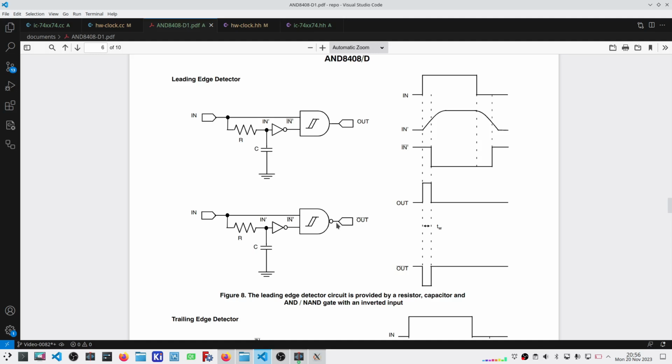Well, I need a couple of AND gates added in. And surprisingly enough, I have two that aren't used. And what I want to do is drop those into the circuit ahead of the set reset latch so that each one of those signals can operate that latch and change the behavior. Okay, I'll make those changes in code and I'll put in some temporary signals for that.